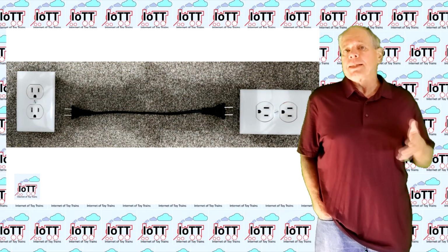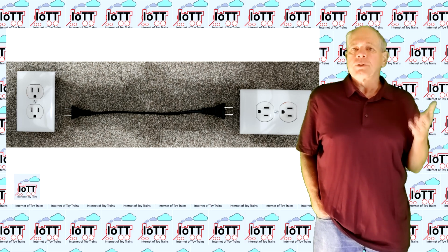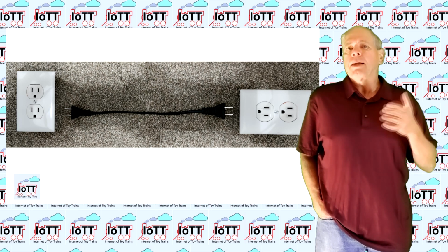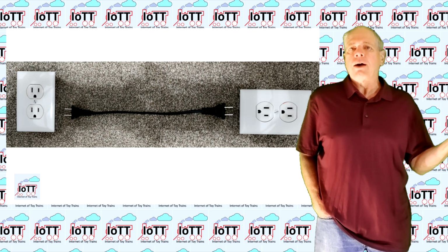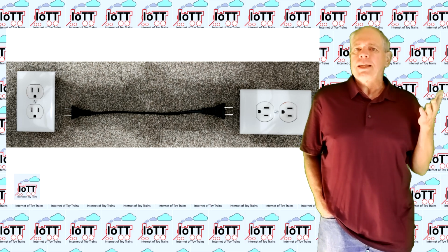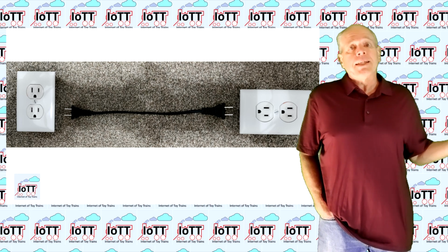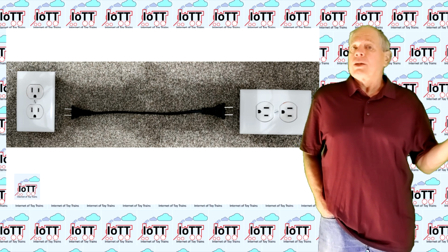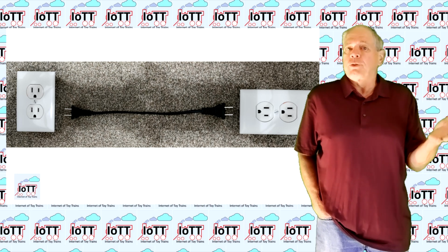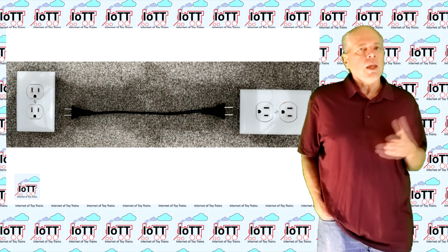So what he did is installing an electrical outlet on the front side instead of the cable with a plug, and then used a few feet of cable with 2 male connectors to bridge between the wall outlet and the outlet on the layout to power up the transformers that were installed underneath the layout framework. Very aesthetic and of course it worked well, so problem solved. And safe as long as you always first connect the layout side and then the wall outlet.